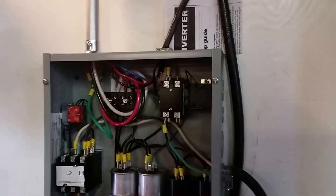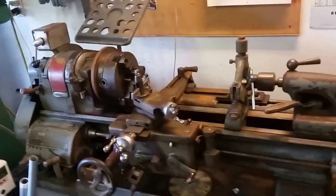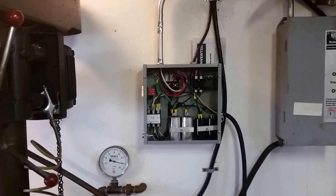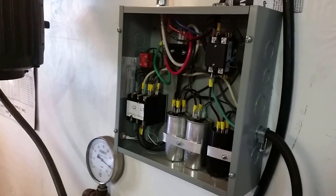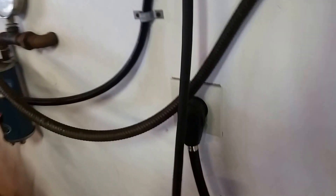You want your converter to be more powerful than whatever the largest motor you want to run. This machine's a two horsepower motor and I believe that's a three-quarter horse motor. I figure probably the biggest motor I'm ever going to want to run is maybe five horse, so I thought seven and a half horsepower would be a pretty safe bet. Plus, I got the seven and a half horsepower motor off the job — we took it off an air conditioning unit I was decommissioning.